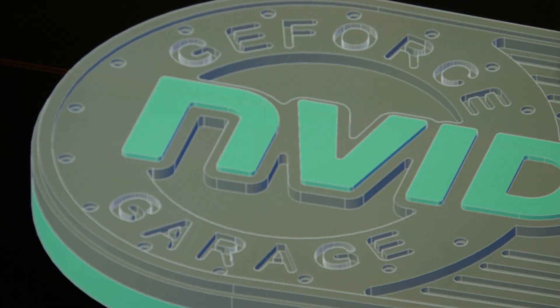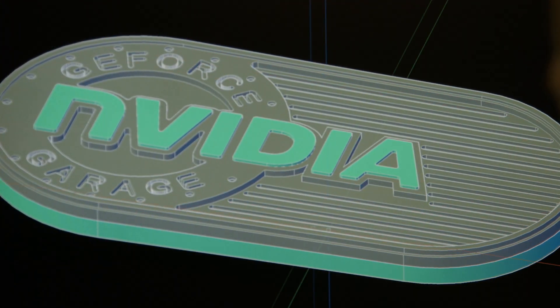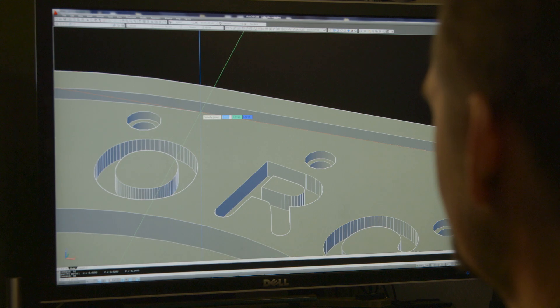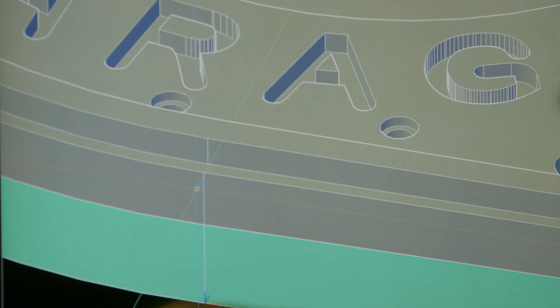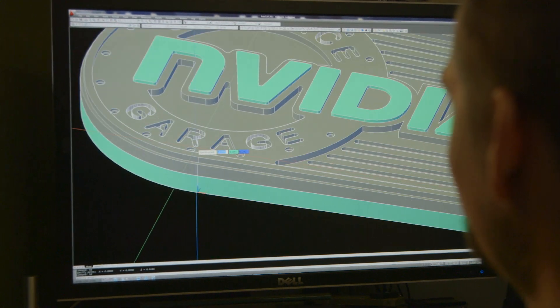I need to determine the depths. First I'm going to cut this whole thing down to the lower level — that's the thickness of my sheet. My Z level is at 0.224, so I'm going down 20 thousandths of an inch. If you touch off on the top of the material, you run the risk of crashing the machine because everything you're programming is Z negative. If you touch off to the table, everything is Z positive — so anything ending up Z negative is a red flag, because you'd be cutting your table.